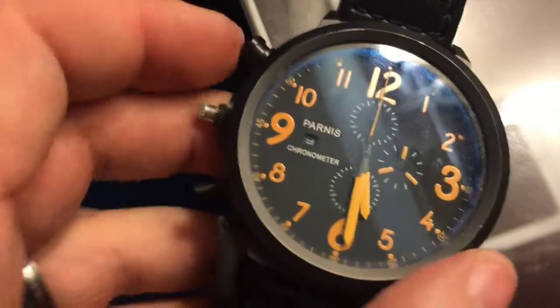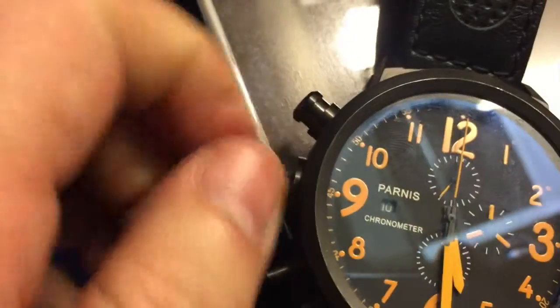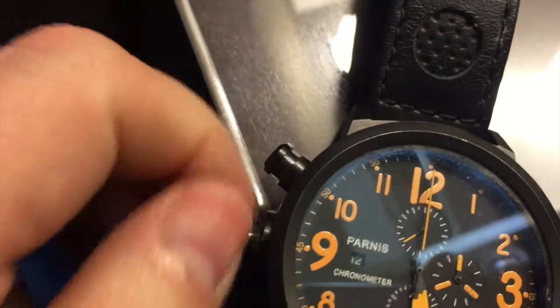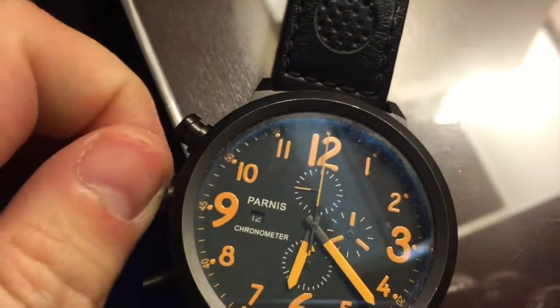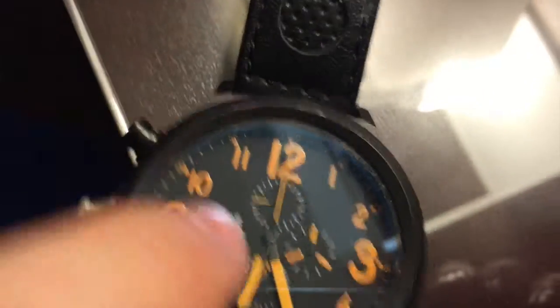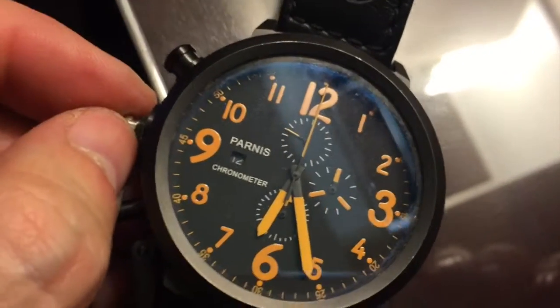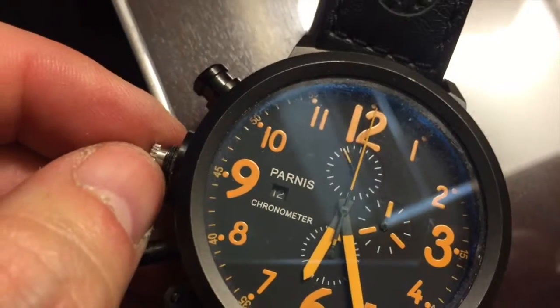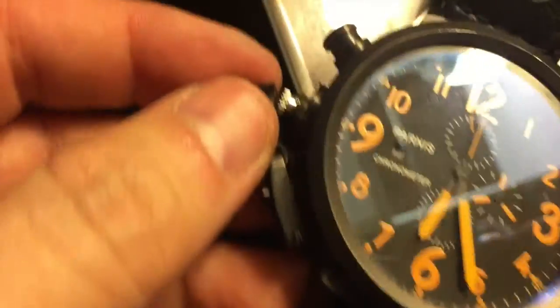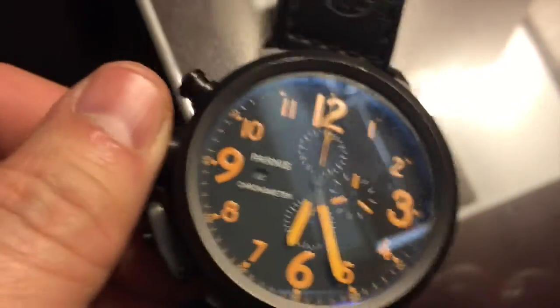Moving the hands — half a turn and there we go: 10, 11, 12. That works fine; it only goes in one direction at the intermediate stem position. At the outer stem position you set your hands, and as you'll note the top display has stopped, so it's hacking. I've set this to be in sync with the national atomic clock and over the course of a few days it hasn't drifted even a second. The screw-down crown holder goes back on very positively — nice and tight, feels great.